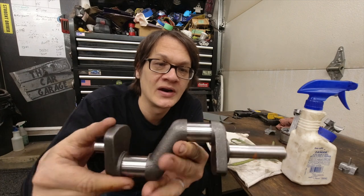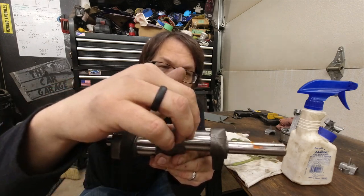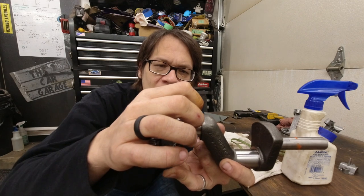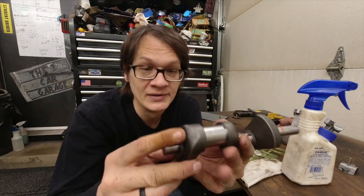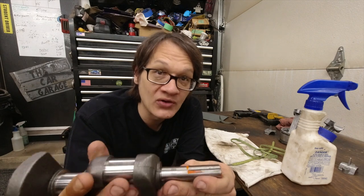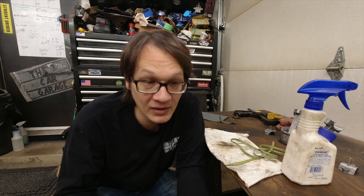Well, there we are — all taken care of. This journal that was in good shape actually turned out real nice. It just has a smooth, silky clean finish — that one's ready to go. The journal that had the bad rod has some scoring and some weird pitting going on in there, but when I run my fingernail and my fingers across this it feels fine, so I'm just going to send it — we're going to live with it. The mains polished up okay too. They do show some signs of wear, but they just ride in bronze bushings, so again I'm just going to live with it. Truth be told, I probably could have just cleaned this and put it back together and it would have been just fine — the compressor was actually running as is. So this is probably more than adequate for what we're trying to accomplish, but any little bit I can do to make this work better, I'm going to go for.